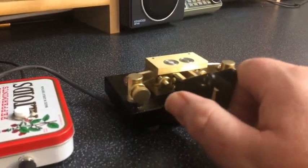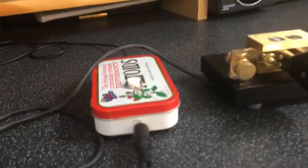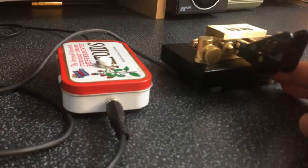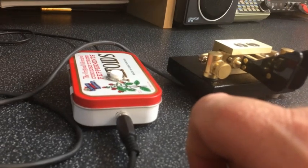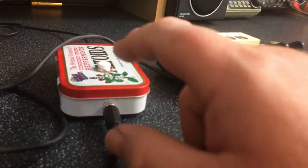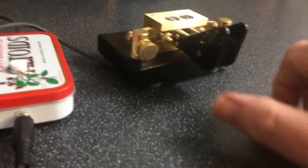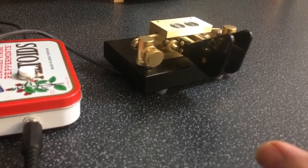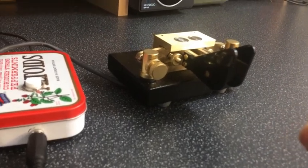There's a whole pile of things you can actually do with this. I'm going to have a little list because there are so many features. If you want to know what speed we're currently working at, you press the command button — there's a list of letters you can send to the keyer for instructions. The one to find out the current words per minute speed is W. So we press it, you get a question mark — it's waiting for you. So we send a W, and there we go: 15, and the R at the end means it's ready to receive the next instruction.